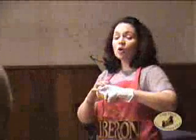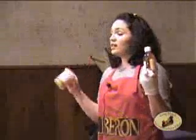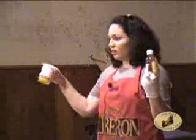Valens sells one called Super Blonde, and that is just a very light color. This is similar to that. It's called Special Pale. The difference here is that this is pre-mixed. So how you mix shellac is with denatured alcohol. That's all. It dissolves. You can't really see that these are big bunches, but you can see the color, how dark the color is.